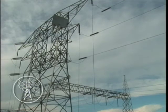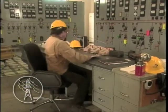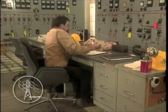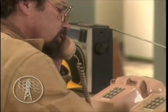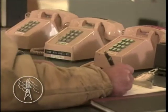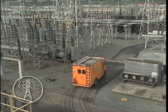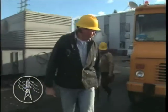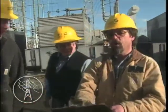When you find yourself working on low voltage or non-electrical equipment connected to a high voltage clearance, there are two ways to proceed safely. Supplemental Lockout calls for the clearance holder to expand his area of responsibility to include non-electrical and low voltage equipment. The clearance holder secures and de-energizes the low volt and non-electrical equipment, places all applicable locks and tags, and lists their placement on his clearance card. When other electrical and non-electrical workers sign on to the clearance card, each worker is equally and effectively protected from high and low voltage as well as mechanical energy hazards and does not need to place their own locks and tags.